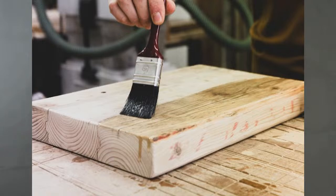Now this might surprise some of you, but solid timber benchtops are mid-range on our list of maintenance. And the reason is it does require more maintenance, but it is relatively easy to do. Like I said, wax your wood. If you choose an oiled or waxed finish for your benchtop, then once every 6 to 12 months, you get the beeswax out, give it a bit of a buff and a polish, and you're done. Whereas some of the other things on this list require professional equipment, chemicals and the like to come in and buff or polish or rejuvenate and maintain your benchtop. So that is why it is in the middle of the list.